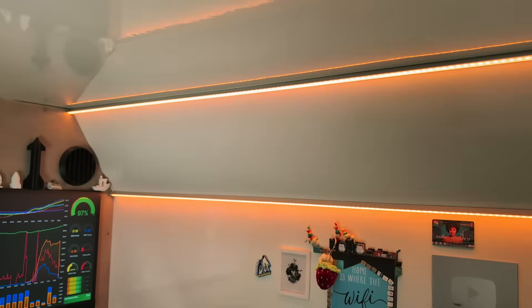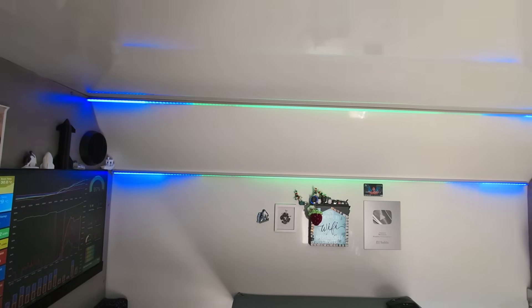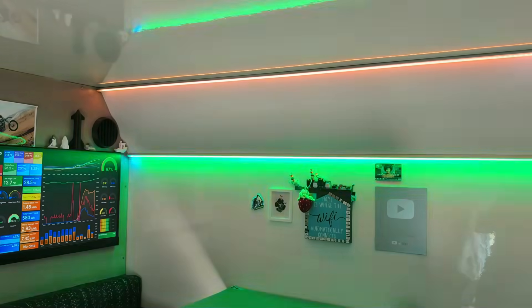I'll put a link to these in the description if you're interested. Unfortunately, even with these, I still saw the same weird glitching in the LED patterns. So then I blamed electromagnetic interference from the PWM powering the white LED strips that share the same aluminum extrusion. But then I made an interesting discovery: when I disconnected the data line from one strip but left the power connected, the amputated strip was still mimicking the LED patterns from the one left connected. The data wires were acting as antenna, transmitting and receiving interference from each other. Even with only half a meter of parallel wire run, it was enough for them to talk over each other and cause chaos.